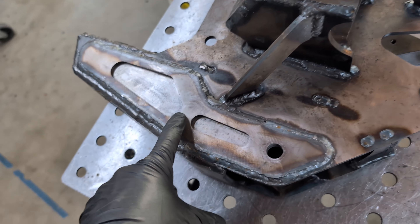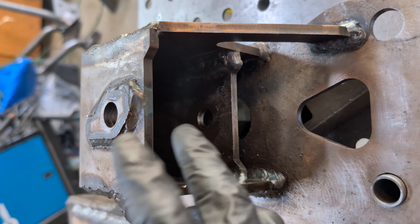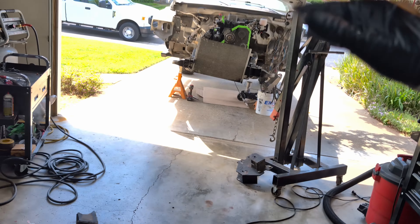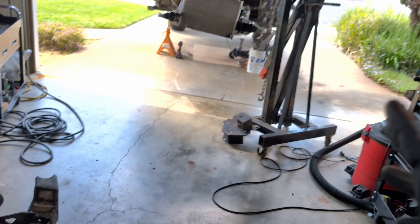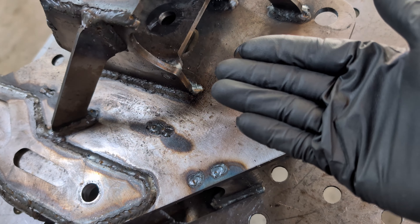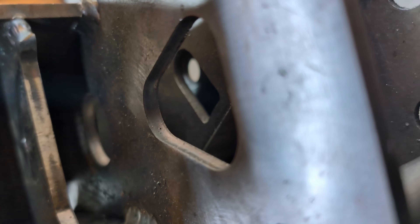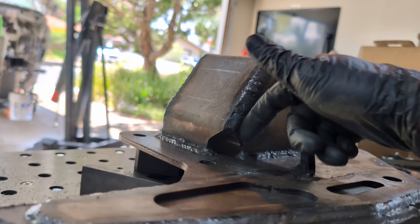This whole design is using quarter inch plate, except for this plate on this side — and the other side as well — and then these weld washers, which are three-sixteenths, just to make sure these bolt holes are not going to oval out. The design itself has the upper arm offset from the main body, and there are two purposes to that. One is to make installation super easy — you can just put a wrench on this side, hold that nut in place while you torque it. Eventually I'm going to put skid plates all under the bottom, and if I needed to take a joint out or an arm out, I don't have to remove the skid plates — I can just fit a wrench in there. The other thing is the bolts are already angled to match the angle of the cross member in the frame, so this offset keeps the upper arm away from those bolt heads so it's never going to hit. The bracket cavity is all connected to each other, and they all line up with a drain hole on the upper bracket — so if you're parked on a hill and water collects in there, it has somewhere to go and it's not going to sit and rust out.